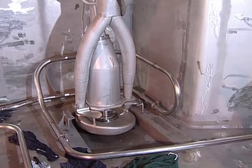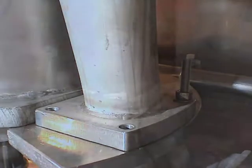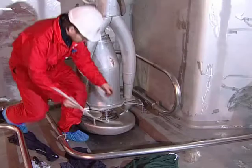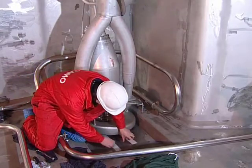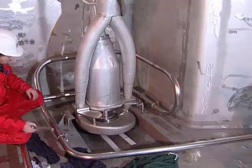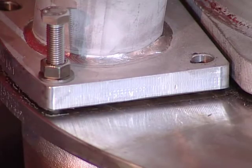Remove the rest of the bolts on the cargo flange and also between the volute casing and bearing housing. Finally, the volute casing, suction cover and pump impeller are now hanging by the lowering lifting bolts, diagonally positioned on each cargo leg. To avoid damage on the tank top, use plastic strips when sliding out the unit. Lower the whole unit down carefully, turning the lowering lifting bolts in parallel.